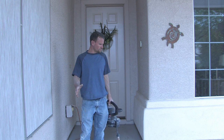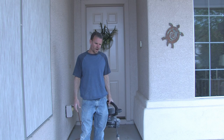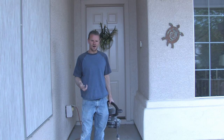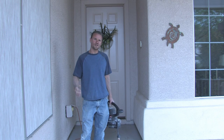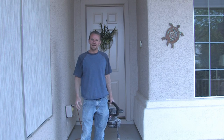I'm going to be prepping this concrete front porch for a concrete overlay. I'm going to blow it off and do an acid wash on it. That cleans out the pores and cleans the concrete up. It also makes the alkalinity of the concrete just right for a concrete overlay. Then you neutralize that acid and do a nice pressure wash on it. Pressure washing gets that acid and the soupy stuff out of the pores and gets it cleaned up for a nice bite for your overlay.